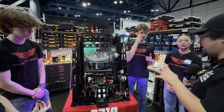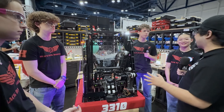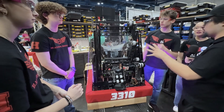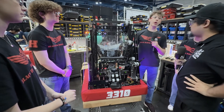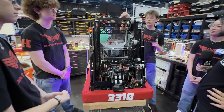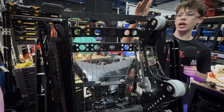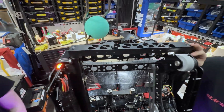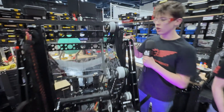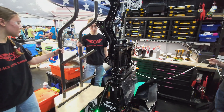Talking about that weight — when I saw pictures of the robot I saw so much pocketing I was worried about durability. How has the durability been? It's actually been very durable. We use a triangle pattern with the CNC machine, which really helps with durability. We haven't run into any problems — there hasn't been any denting or bending of the aluminum. The elevator is pretty sound and we haven't had very many problems with it.